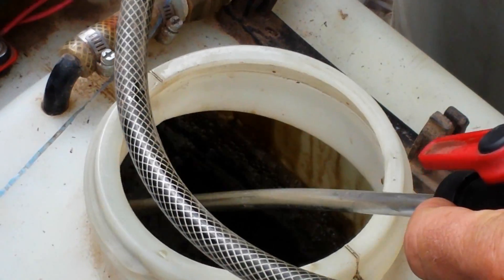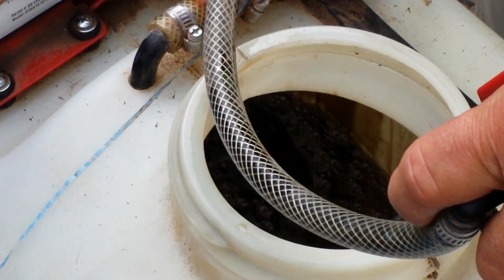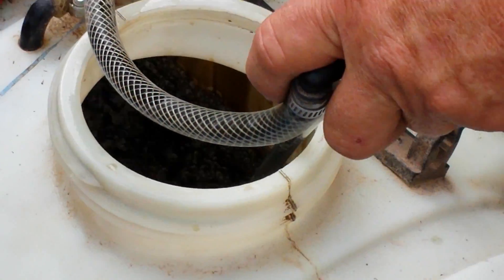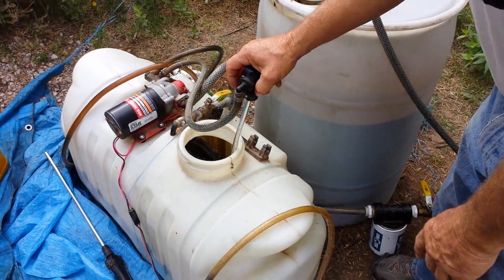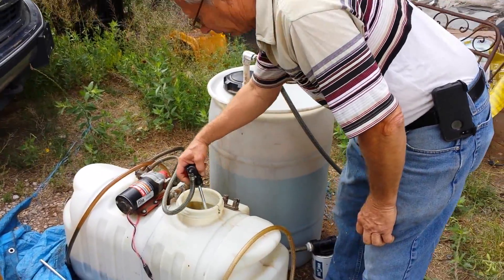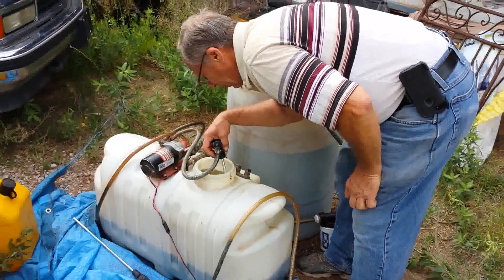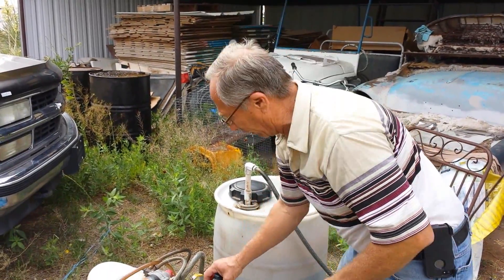Shift this valve off here to the tank. Now look how fast it flows — see that? Point this all the way to the back end and all the way here and it's circulating the used motor oil and the diesel together. We need to do that for four or five minutes. It'll mix it real well and that way it's blended like it should be.